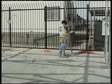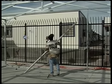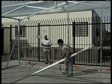Installing the back verticals. The back verticals in this building are 2-inch by 2-inch tubes and there are three of them. The middle one is 125½ inches long and the other two are 110¾ inches long.